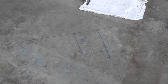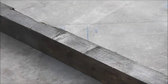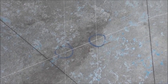What we're doing here today is scribing a truss together. I've laid it all out on the concrete, which is pretty flat. I have two different trusses I'm making here — R7 and R9 on this side, and R8 and R10 on this side. The collar will go in the middle and the king post is going up. I've already drawn my angles where my collar will meet my rafter, set my depth for how much the collar will go into the rafter, and we'll go set them up now.